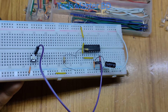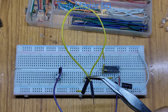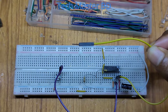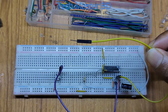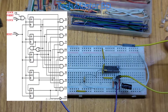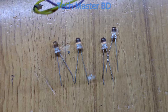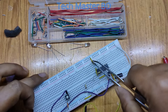Now take a wire to connect the input push button to the IC. The circuit is now complete. On the other hand, we need some output and also need to wire the reset pin — this is very important because we have to set the count limitation. This IC counts decade from 0 to 9. I'll use LEDs to show the counting.